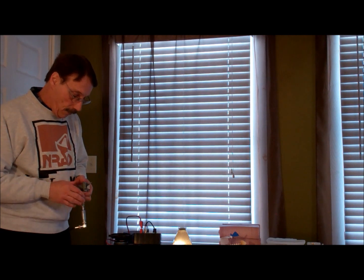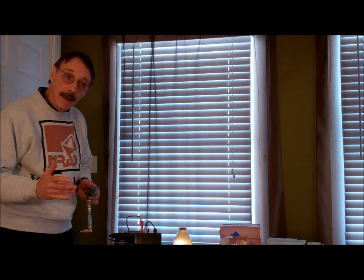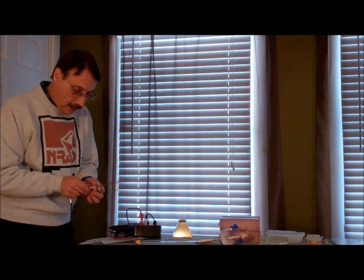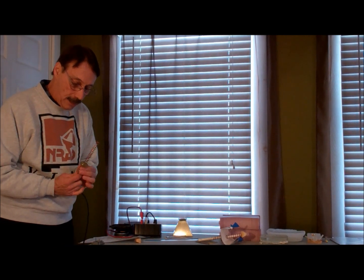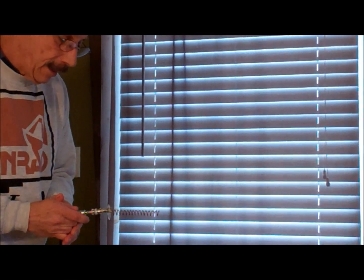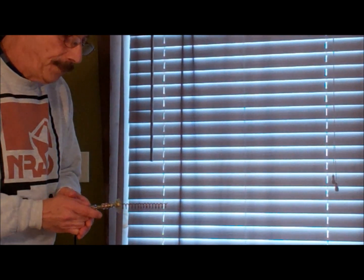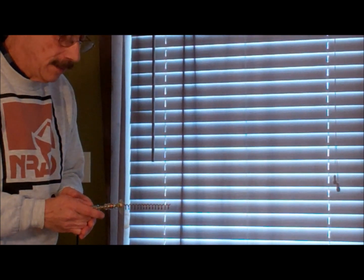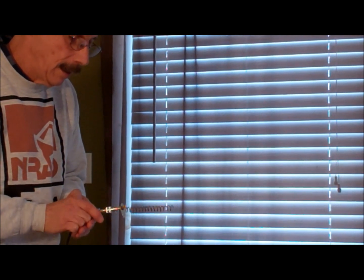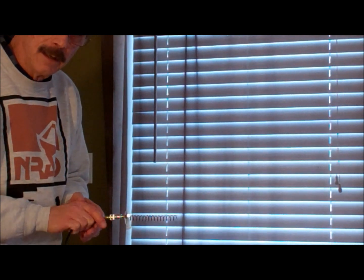Let's cut and meet over here to show some other antennas. We've got a horn antenna and that's the signal we're getting. The first antenna I want to show you is a helix. Unfortunately this was made by me, so the signal strength isn't quite as good as it's supposed to be, but you can hear it is gathering some signal. And it is circularly polarized, so I can turn it and I'm not losing the signal.